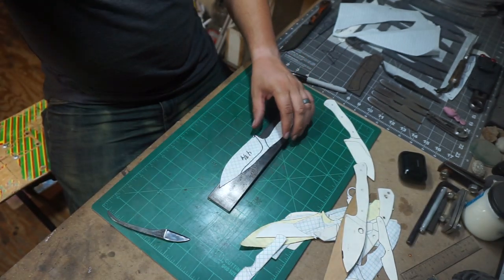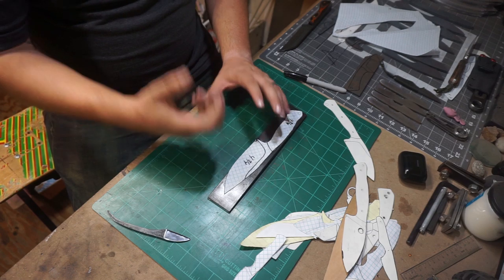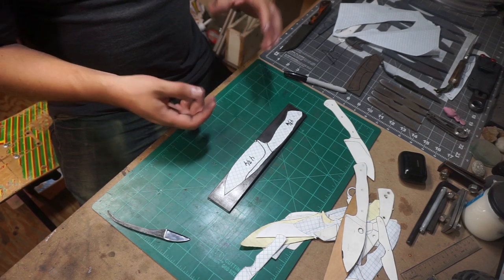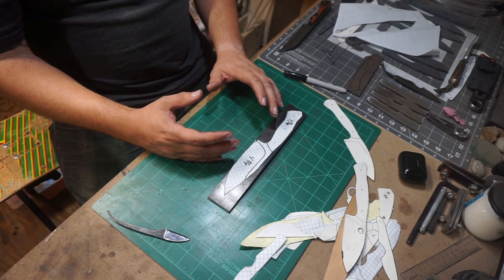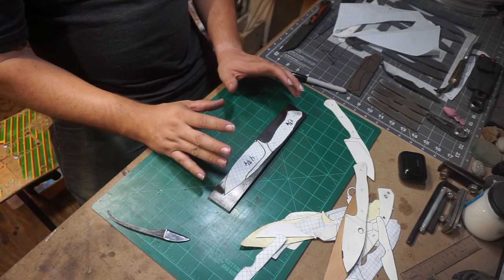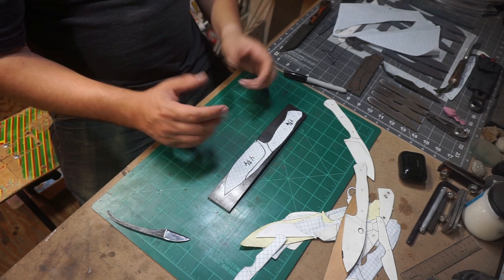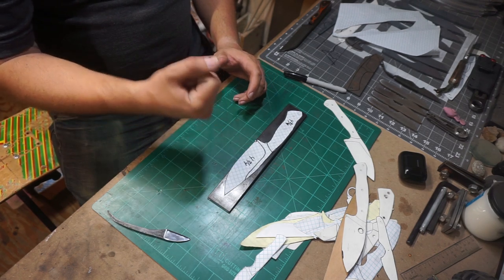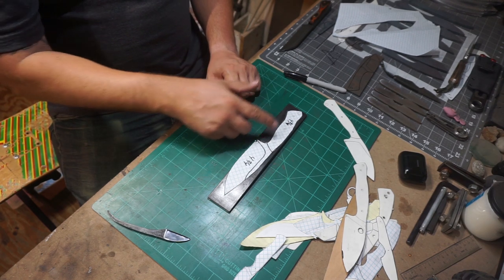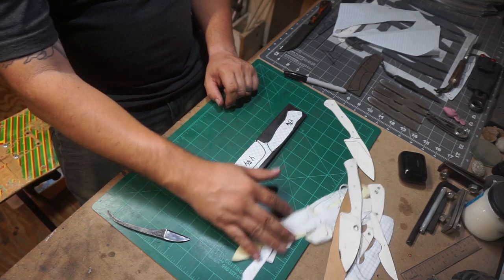So, you know, I take design characteristics off of knives that I've made, and I know how they feel in the hand, and I know what they feel like whenever you're working with them, and I use that. So again, it's all about thinking about what you're going to be using it for, and then if you've made a few knives in the past, knowing how those grips feel in the hand and the ergonomics, and just trying to base your decisions on things that you know that work. Even if you've got to grab one of the knives that you bought from somewhere, put it in your hand, see how it feels, and take some of the characteristics from that knife, I would suggest going ahead and doing it. And use some of the cool things from there, but then make the blade your own. That's what I do with all of these guys right here.